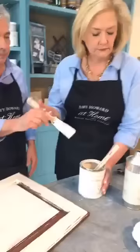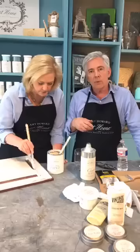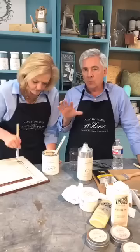Okay. Amy, there is a question. Sarah wants to know, do you recommend using a roller for larger areas? And if so, what kind? Gene, what do you think? Well, if you're painting your kitchen cabinets and you start mixing the application with a brush, with a roller, with spraying, you're going to get three different textures. And so you want to keep it uniform.